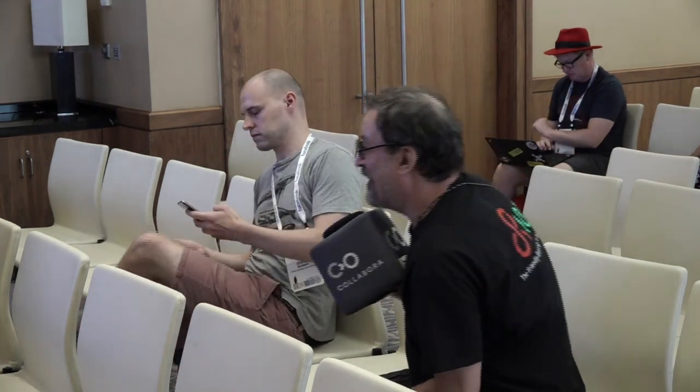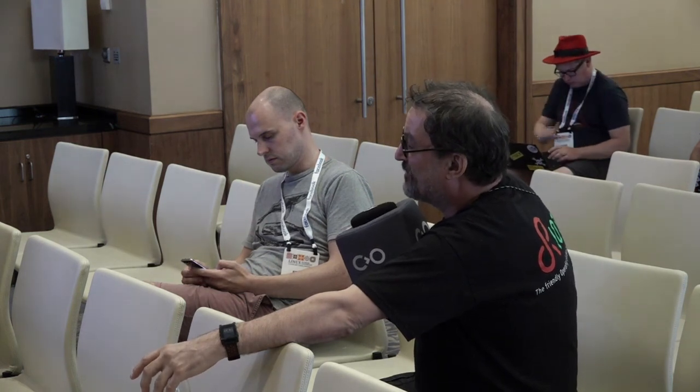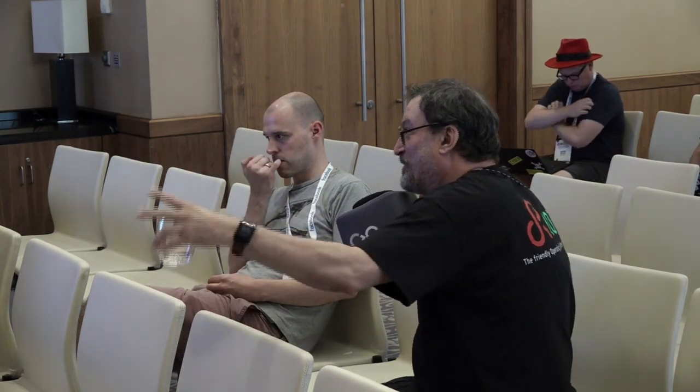So this is really interesting, and you guys have presented this as kind of, this is how you talk to your GPIOs, right? But I think it's a lot more than that. I think you just fell over the edge, and you just said you're doing it over 15.4, 6LoWPAN with Zephyr. Well, you've described a discoverable network protocol. There are a bunch of other ones out there that do similar things, but they don't generally do them at the level that you've described. So when we were talking earlier about reasons to have Linux gateways into 802.15.4 networks, well, you've just created that. You've just come over the hill from a different direction than we've been walking up, so it's nice to meet you at the top of the hill.